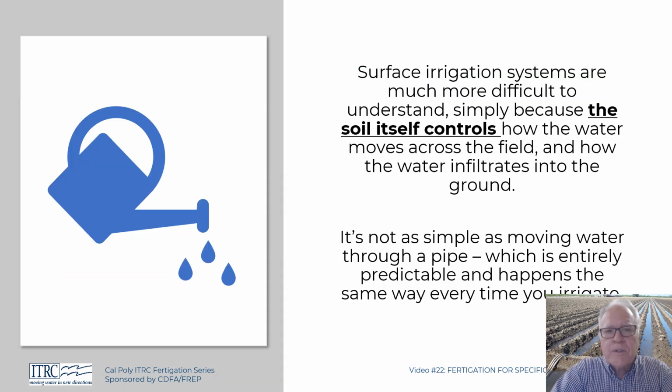I'm going to start with a section on surface irrigation, and for some of you it may not be interesting at all. That's the way it goes, but for others it's real important. They're difficult to understand, so I'm going to, well, I don't know how simple I can make it here, but I'll give it a try and have a few graphs. But the first thing is, this is entirely different from sprinkler and drip because the soil itself controls how the water moves across the field and how it infiltrates into the ground.